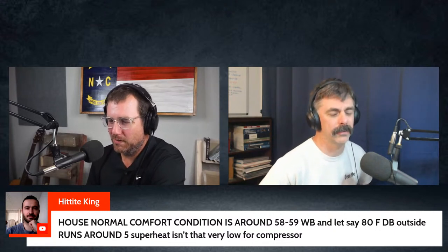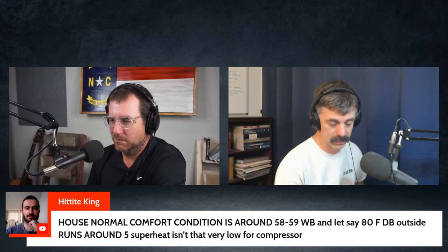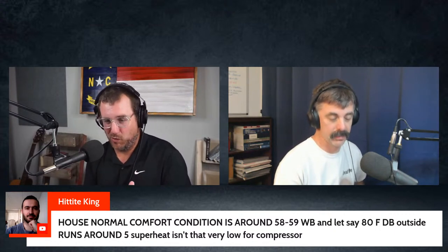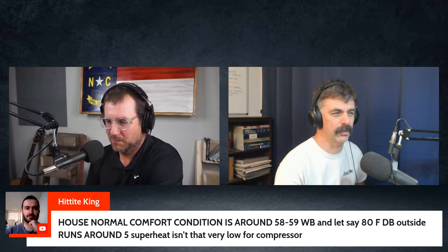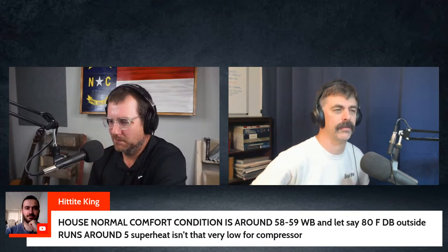So, I'm sorry, 58 to 59. Wait a minute. Wet bulb. He's saying wet bulb. Sorry, I'm thinking dew point. Yeah, that's right, because there's like four or five terms here. We have wet bulb, dew point. No, he's at dry bulb, 5 degrees superheat. So house normal comfort conditions around 58, 59 wet bulb.